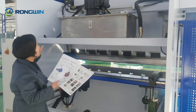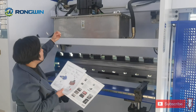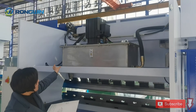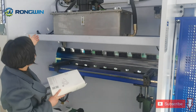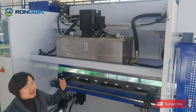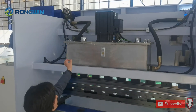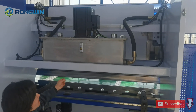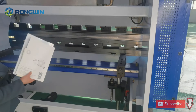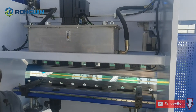Sometimes for a normal press brake, we should install a cooling system. But for this kind of machine, we don't need the cooling system for the hydraulic tank. Also, with very little hydraulic oil, this kind of design means the machine has very few hydraulic pipes, which is very good for future maintenance. According to our experience, press brake problems are often caused by hydraulic pipe blockage and valve blockage. This design can avoid these problems, with very little hydraulic oil, a well-designed hydraulic tank, and simple hydraulic piping.